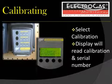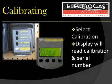We will now cover the calibration process using the BW Microtalk 2 system. Again, you must allow your monitor to warm up for 2 to 3 minutes, ensure your battery is adequately charged, and that your charging or IR port is clean. You may now select the calibration option on the test module. The display will show calibration and the serial number of the monitor.